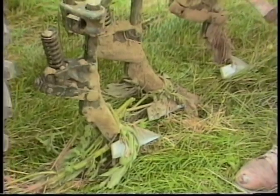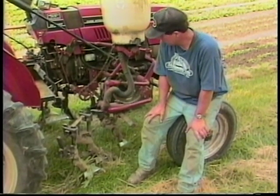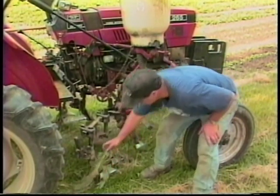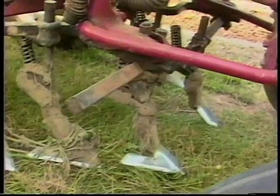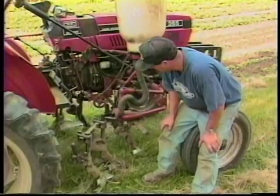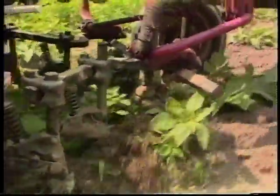This tractor, like the other Kubota, is an offset high-wheeled tractor. With it came a full set of sweeps and shanks. We have a couple of discs we use for hilling. We use this to go after weeds when they get out of control in crops like beans — here's a red root pigweed that was a pretty good sized beast. These shovels are good at doing just that: they bury and root out. They're very aggressive. We also use them to cultivate the edges of our plastic. On the front I have a half sweep — basically a sweep with one side cut right off — and I can get right up close to the plastic, side dress the edges, and throw dirt on top of the fertilizer all in one pass.